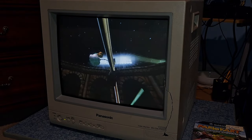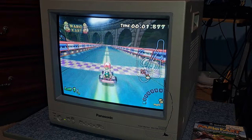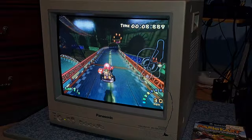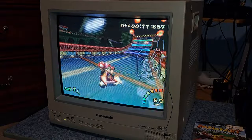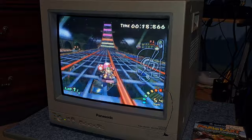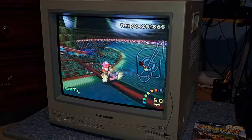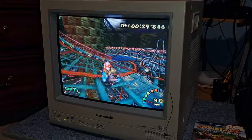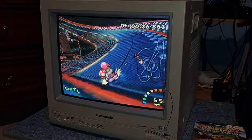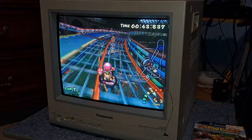This is a 14-inch dot mask video monitor, which is really cool because you typically don't find dot mask video monitors — they're basically shadow masks. I like to call them dot masks to denote the difference between a slot and a dot mask shape. When I found out it was a dotty I was very happy because I really like the look of dotties — I like them way better than Sony Trinitron aperture grills and slot mask sets. Most video monitors that aren't Sony will typically have a slot mask, except for higher-end ones or those with Mitsubishi Diamondtron aperture grills.